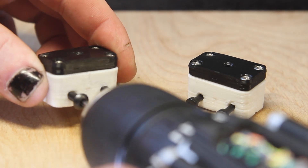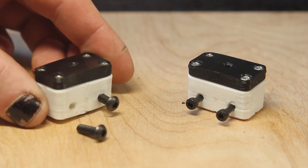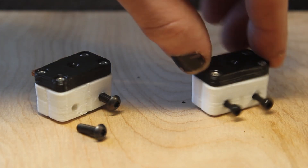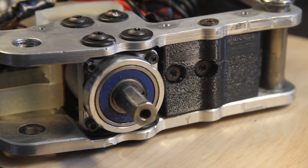Style 1 is M4 machine screw direct into the TPU. Style 2 is a bolt with an M3 machine screw and lock nut. If using through bolts, do not over-tighten — this will seize the moving contact on the inside. Screws should be snug, but not tight. Personally, I use M4 directly into the TPU through the side rail of the robot.